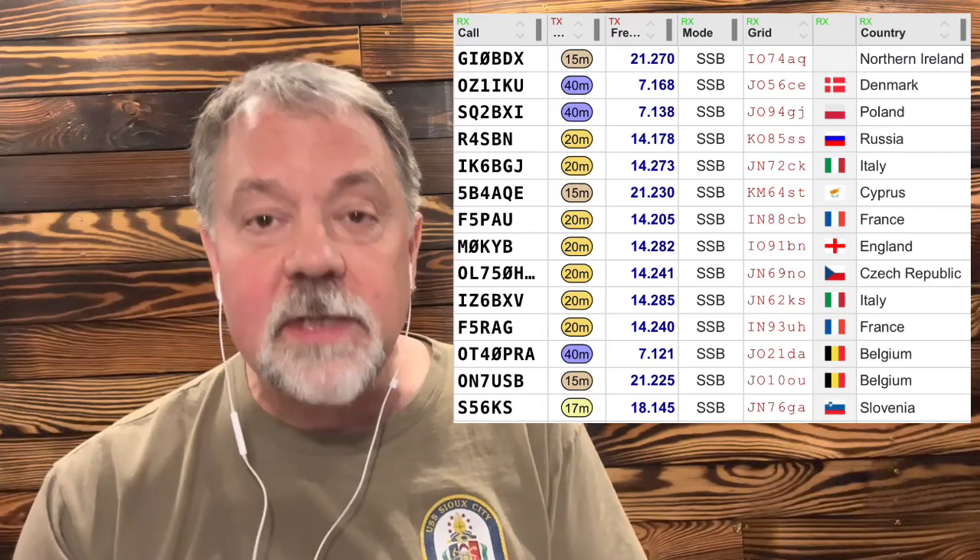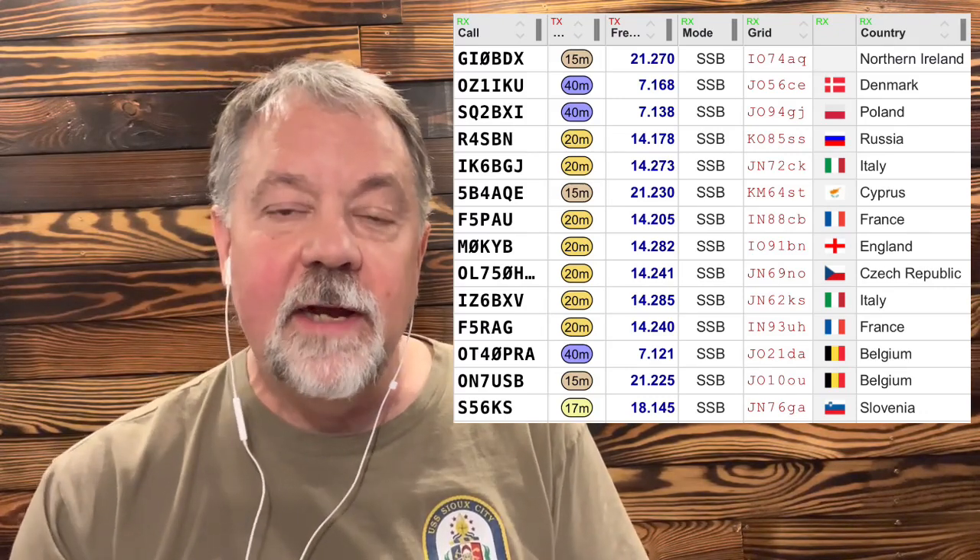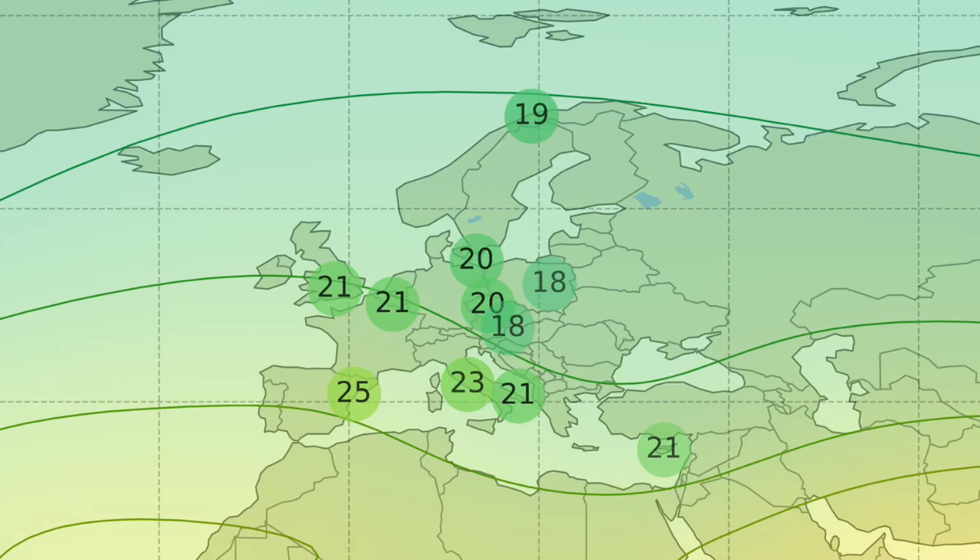I did make contacts across Europe with pretty good signal reports on 40, 20, 17, and 15 meters. Nothing more than that, and it's probably more because of band conditions and not the antenna. The maximum usable frequency — the MUF — here in Poland, where I've been for almost a month, has rarely gone above 20 megahertz. So it's been tough. The band this antenna really excelled on was 20 meters — I was just making amazing contacts and really getting out. I want to show you a couple of QSOs: one at full 20 watts and another one QRP, both on the 20-meter band.